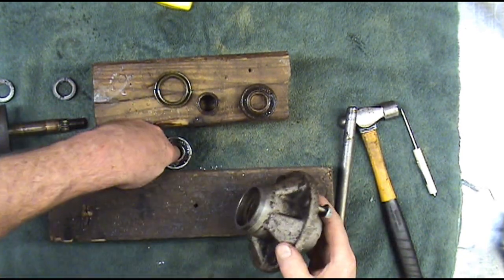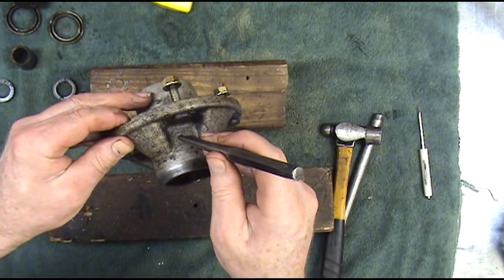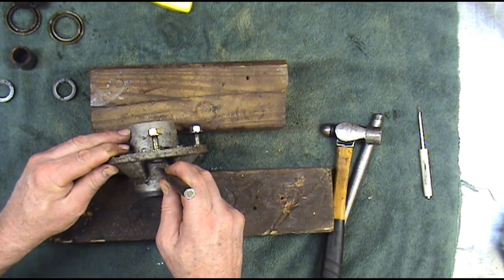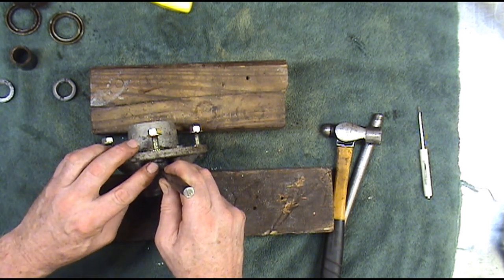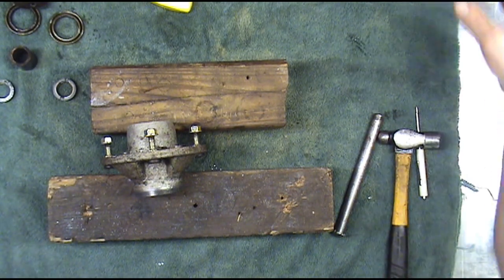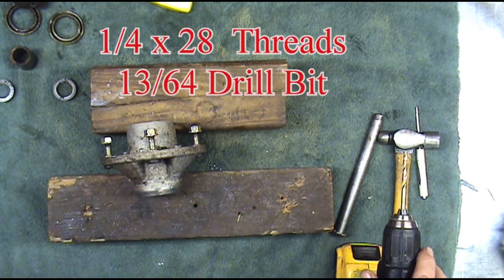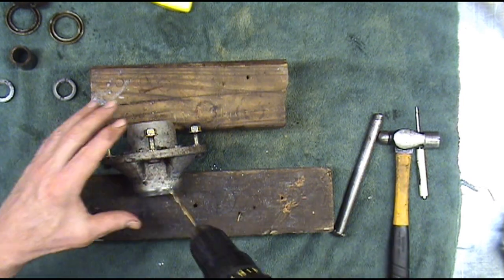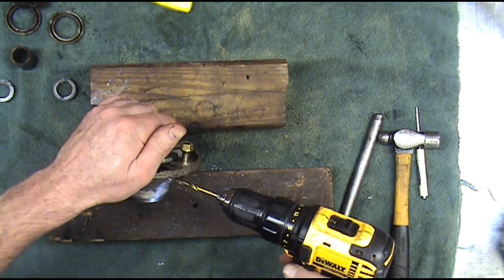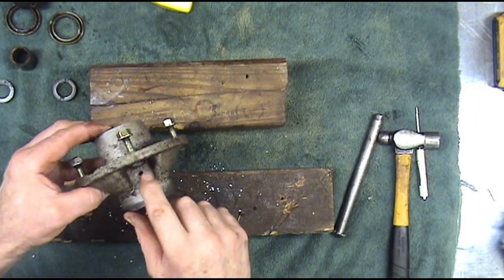Alright, there they are. These bearings are really noisy — they're not even good, and they're not that old either. We're going to make a mark here with a center punch where we can drill the hole for the grease zert. I'm going to come down about a quarter inch from that stud because I need room to get my grease gun up on the grease fitting. We'll make a mark there so the drill bit doesn't walk.